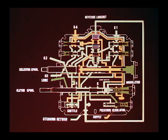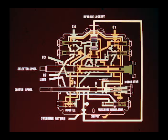With the clutch pedal depressed and the clutch spool pulled out, the pressurized oil available at the supply gallery restricting orifice passes through the orifice and is open to reservoir through the return gallery at the center of the clutch spool bore. As the clutch pedal is released, the clutch spool is stroked to the right and closes both returns to reservoir. The steering return oil is now pressurized, causing the reverse lockout spool to be actuated, shutting off the C4 pilot actuator circuit and opening the C1 and C2 pilot actuator circuits. The C1 clutch is engaged by oil supplied through the operated pilot valve.